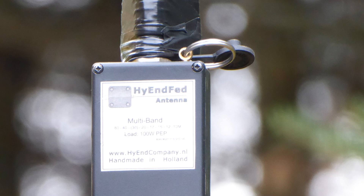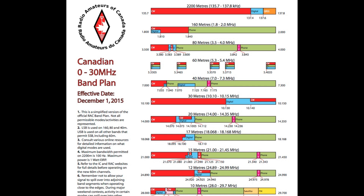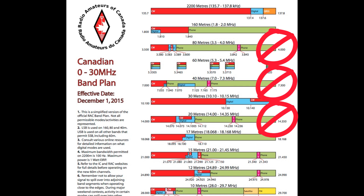I've set it up in a sloper configuration. The final key is how I choose to operate. Most of my activity will take place on the Sunday of the contest. This is because the number of stations generally decrease after many stations get burned out after operating Friday night, all day Saturday, and Saturday night. On Sunday, you'll find less congestion on the bands. Additionally, I will carefully choose which bands to work. Today I've noticed little activity on 80 meters, while 40 meters and 20 meters are absolutely jammed with stations. Happily, 15 meters is open, but nowhere near as busy as 20 and 40. Due to this, I am going to focus my efforts on 15 meters, where my signal has a better chance of being heard.